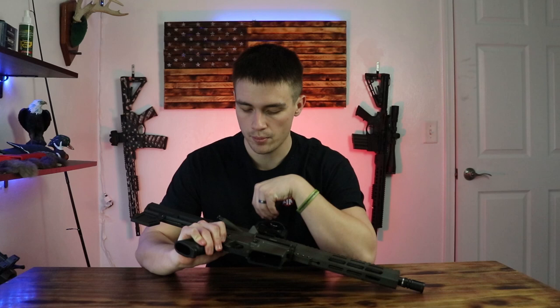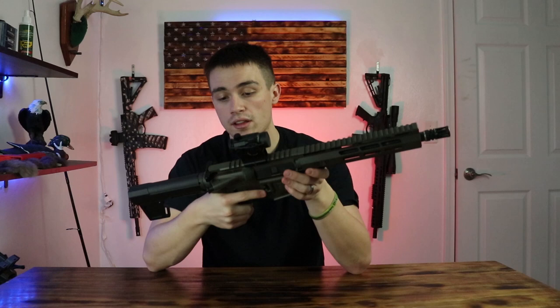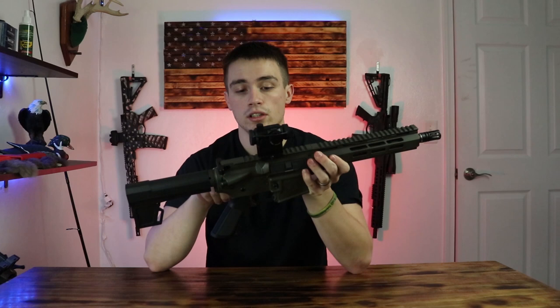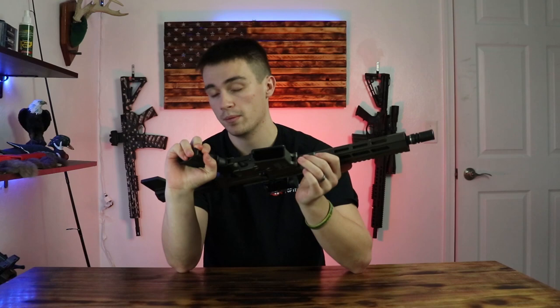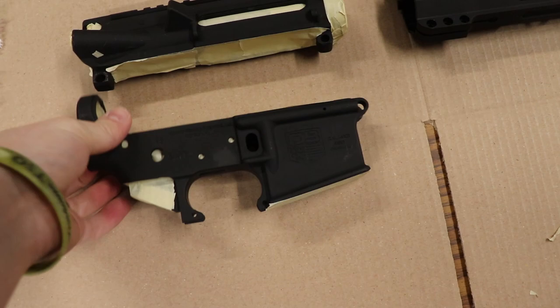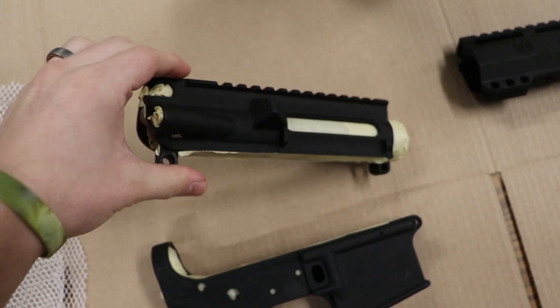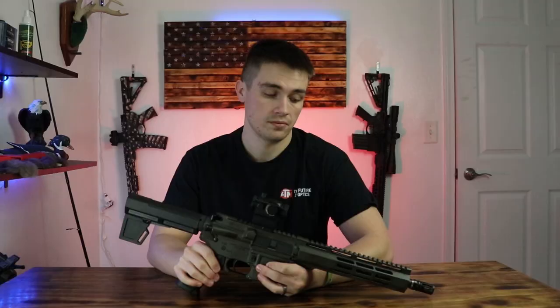The first thing I did when I started to paint this thing is I had it all separated — I didn't have any of the parts together. It was probably before I built the actual rifle. So I just did the lower, the upper receiver, and the rail. I don't really feel a need to spray paint my grip and stock — I wanted the black accents. So I did this pre-build. What I did was I taped off everything that led into the rifle — the mag well and any components that could possibly lead to paint getting in the internals of the rifle, just for safety reasons.